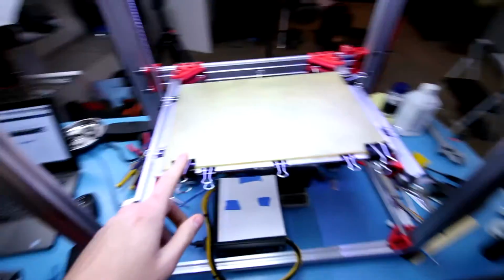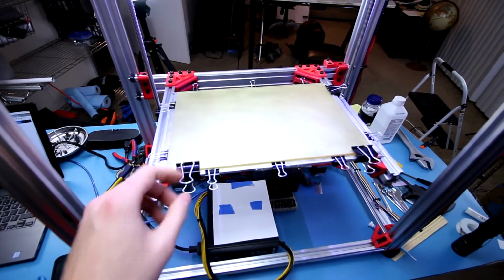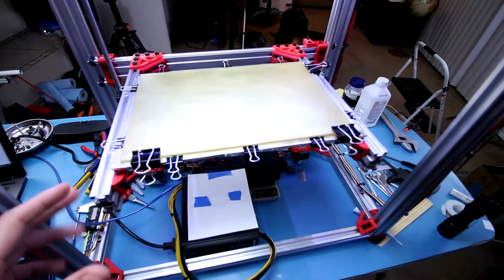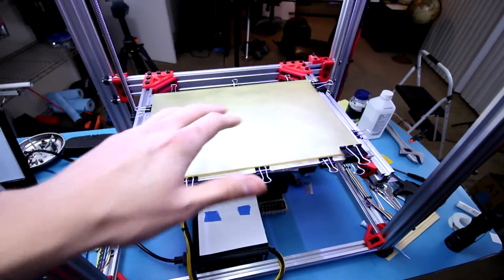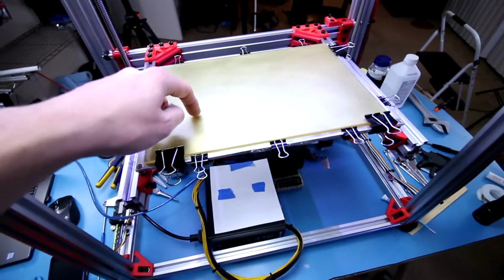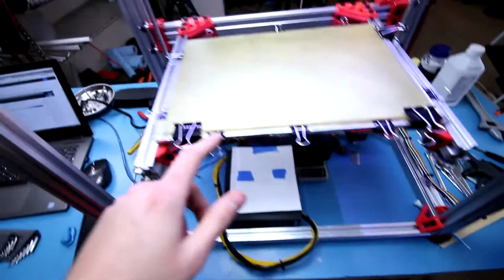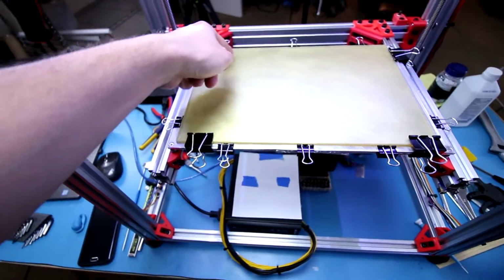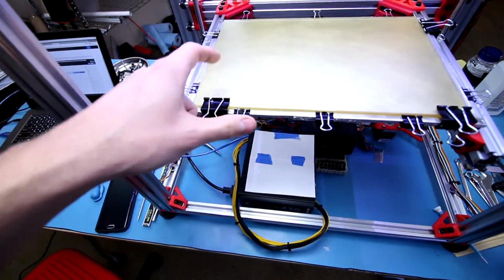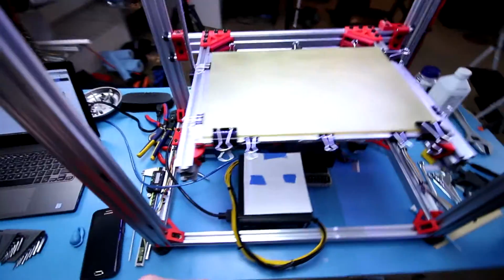All right, everybody, it's been a few days here, almost a week, I would say, since the last video log deal, and pretty much I have done a good bit of changes with the firmware, get everything drilled down. Right now I'm calibrating the bed, which is taking forever, so while I'm waiting on that, just want to give you all an update. As you can see, I bought some smaller binder clips to reduce the amount of lost space in the bed, because these bigger ones, the print head will crash into them, so I have to distance it away from it. Also got the print head calibrated too earlier, so we're good on that at least.